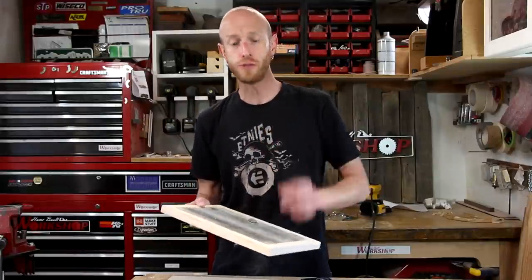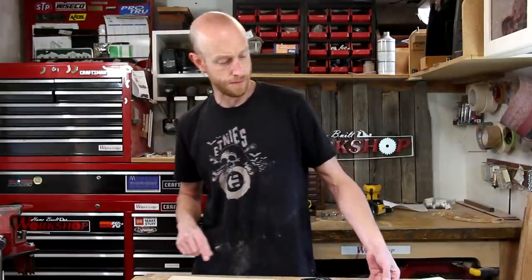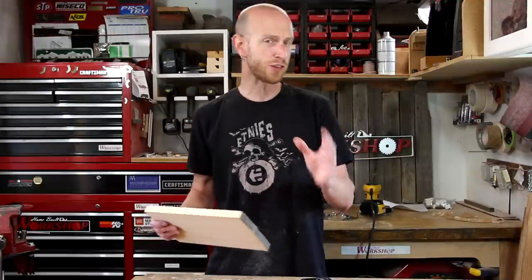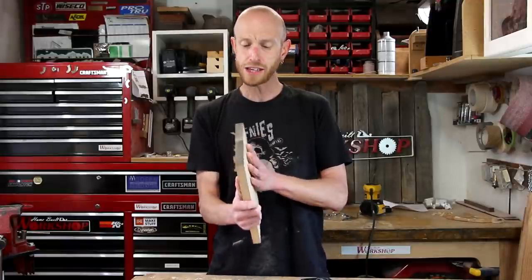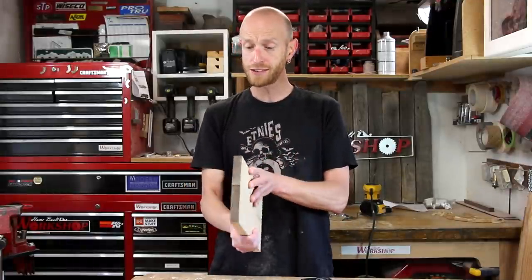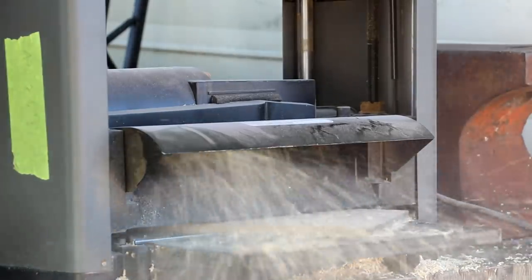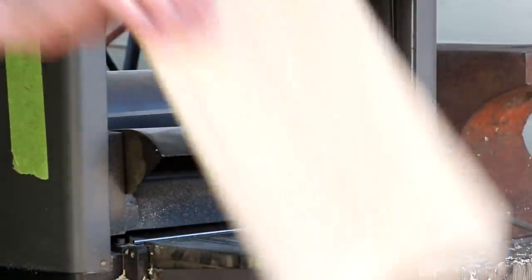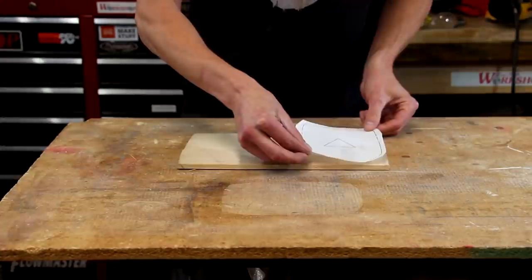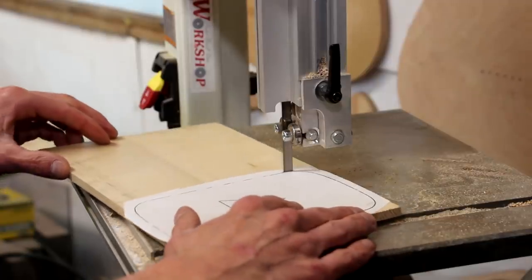After a little bit of sanding I think this part is good for now. I'm going to start working on the actual center, which is going to be the play button. I changed my mind a little mid-build — I'll use this white oak piece for the center, but it's a little too thick so I'll run it back through the thickness planer and bring it down to around a quarter of an inch. Then I'll use some spray glue to attach my cutting template and cut it out on the bandsaw.